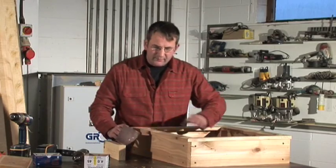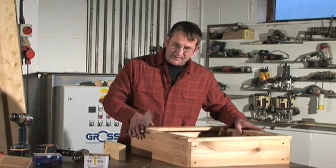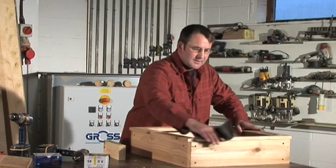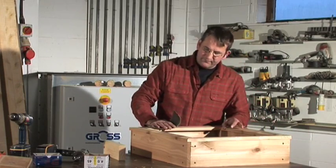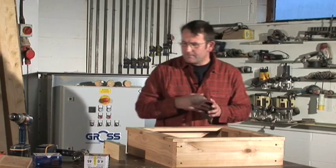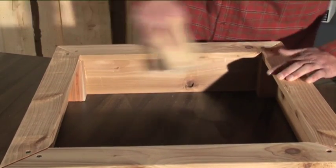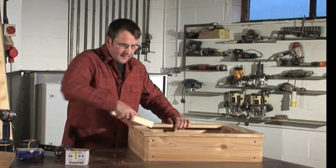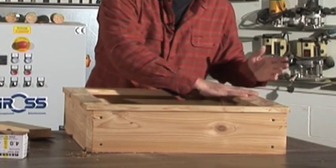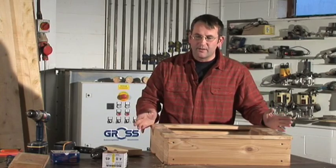We've put the box together now and there's a couple of ways of cleaning it up. One important thing is to take the arises off as well. The aris edge is a term used for this sharp edge here. If you use a piece of sandpaper with your hand like this, it's okay, but what you run the risk of is catching a splinter, and you can't really get into the corners very well. So going back to what we'd do commercially - put it on a block. Your hands are up out of the way, you can apply good pressure, it's nice and flat. So just run it around gently and what you want to be doing is watching for splinters, until eventually it's nice and smooth where you're not going to get any splinters, and it's going to weather down in the garden lovely over a period of time.